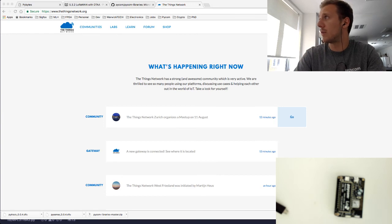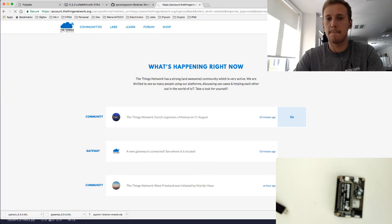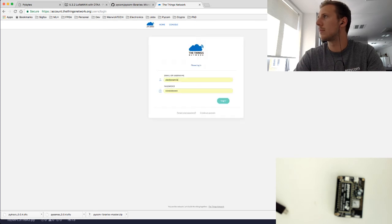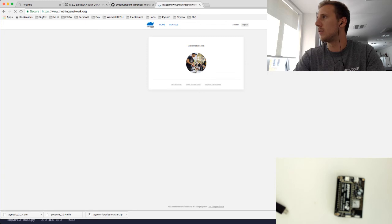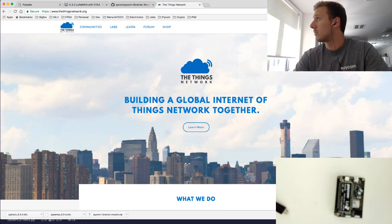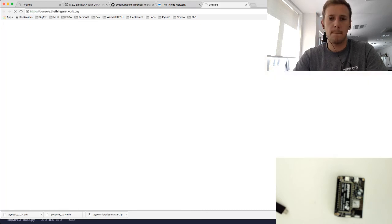I believe one of the issues that we've had recently is they changed it over to using what's called legacy packet forwarder. So you need to change the configuration of the gateway to legacy packet forwarder to actually get the gateway working. See if I've got an example of that now. Just bear with me a second. Okay, Gary's gonna be fine.